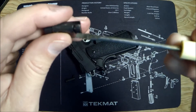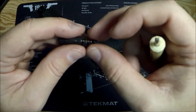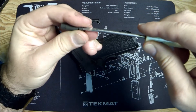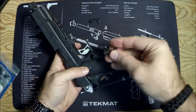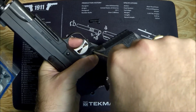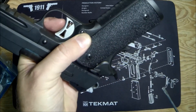To get this out — here's the little lock I was telling you about, this little tab right here. It's under pressure, so just rotate it out to where it releases and it'll pop right out. Grab the magazine catch lock and the magazine catch spring, insert them right in there, press it in until you're in that groove, then turn it so it locks in place. Now it's ready to put back in. We'll put the Wilson Combat one in the SIG — it just drops freely in there real easy — find that spot where it's just right, rotate it clockwise, and it just snaps and pops itself into place.